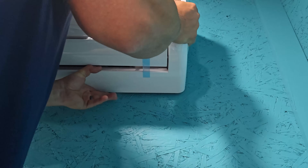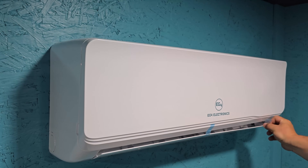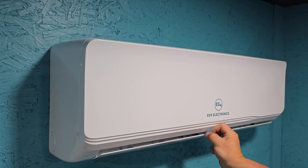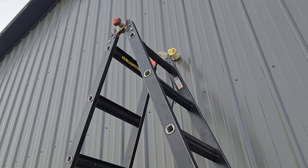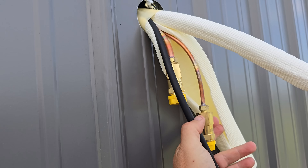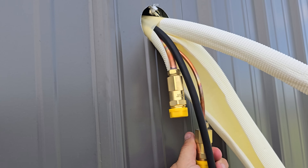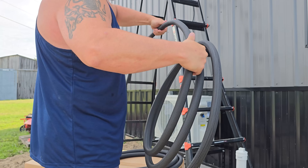Be very careful not to bend your lines too quickly — you don't want to crimp them. Take your time and slowly bend them downward towards the outdoor unit. Then straighten out both lines so that you can connect the indoor unit to the outdoor unit.